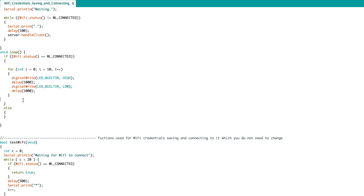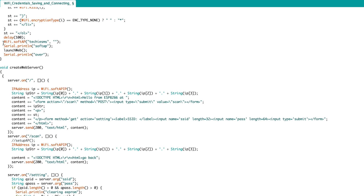For demo purposes, I've put an LED blink code in the loop. One more thing: when the ESP acts as a hotspot, it needs its own credentials. Those are defined in the function called WiFi.softAP — you provide the SSID name and optionally a password. I haven't provided a password because I want it to be an open network. With these credentials, the ESP8266 will act as a hotspot.